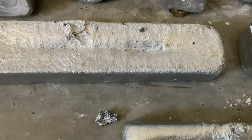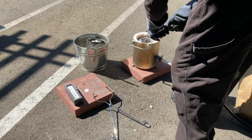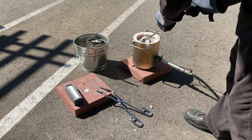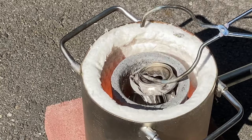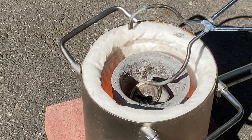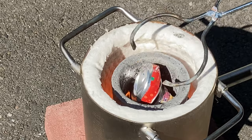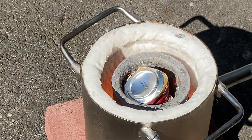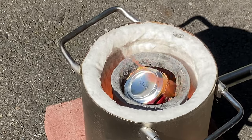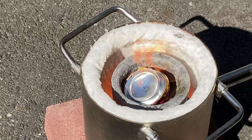Beautiful. Put the crucible back in the furnace, add some PopCans like this. These are pre-toasted so that the labels are burned off and they don't smoke as much — that puts less ash. If we put some in that haven't been burned off, you can see yellow flames and soot. So that's the trade-off: you get the label burning and it puts more ash too.